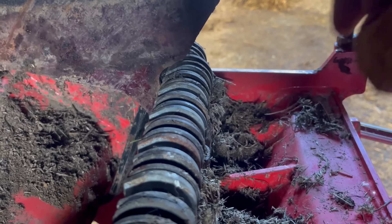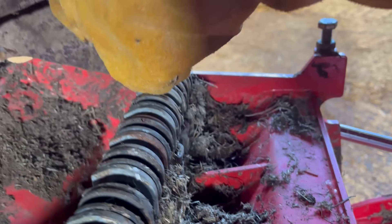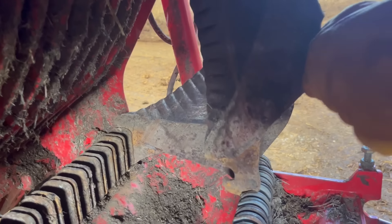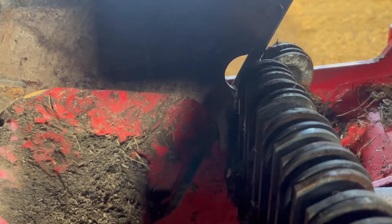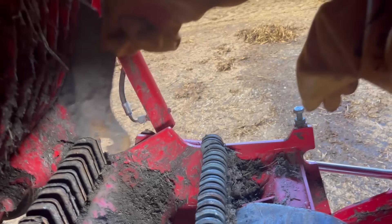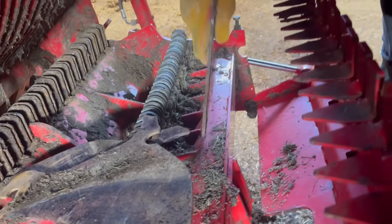So what I do is I use this crowbar. I pull the spring back, and then I got a hand on the blade and I pull up the knife, give it a few shakes like that, and the knife comes out like that. So I put the crowbar down - they're not that hard, but some of them it's a bit easier with a crowbar. Get that up once I get it past there. That one's nice and slack, pull them out. And then I bring them outside and I'll give them a sharpen.